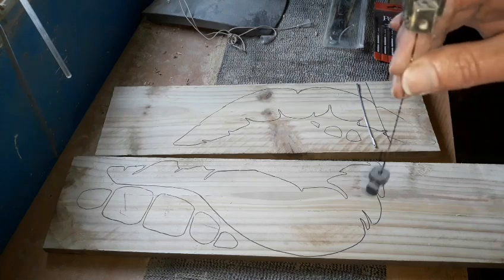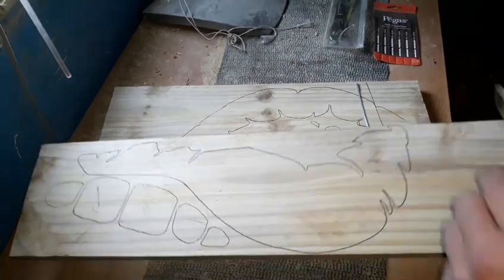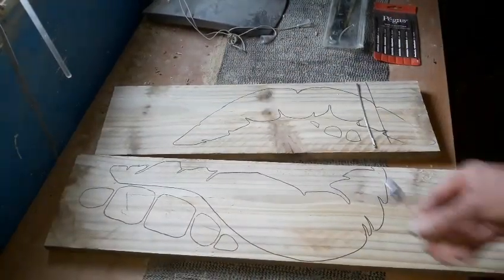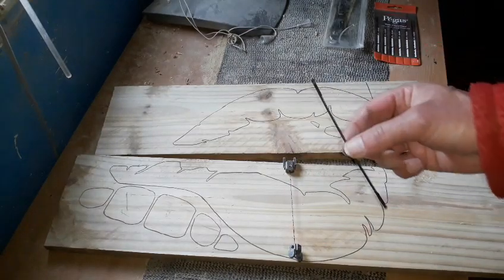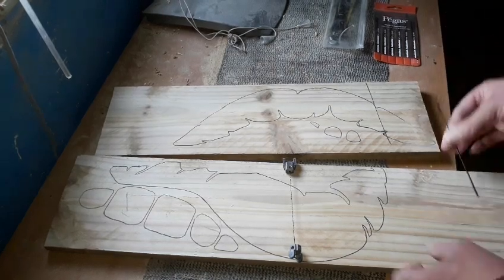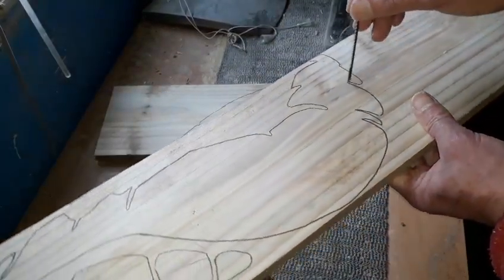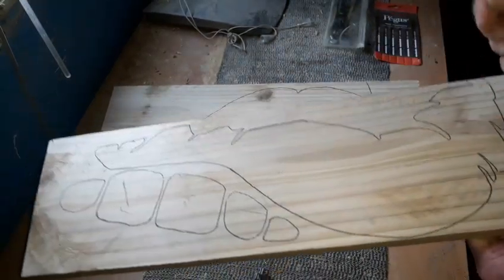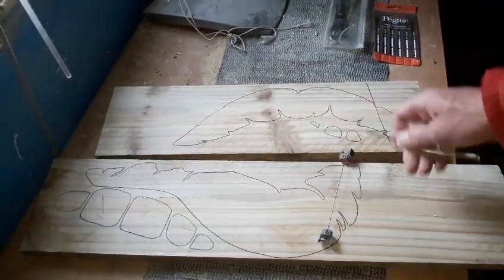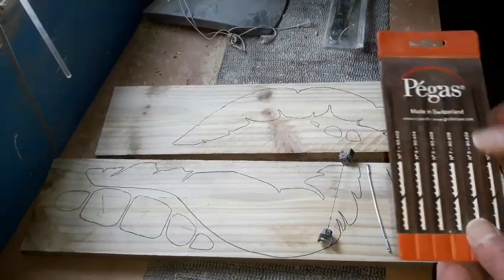I use spiral blades all the time now. I do prefer these - they're not everybody's favorites and you will either love or hate them. But the good thing about the spiral blade is you can cut up, down, left, right. You can basically just go along with your wood and cut it, slide it up and cut it - no turning of the wood whatsoever. Whereas with the pinless blade and straight blade, they only cut from the front. So you'd have to feed your blade in and then turn that full circle each time. If you're doing big projects, you're just not going to fit that piece of wood in your scroll saw.